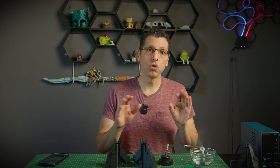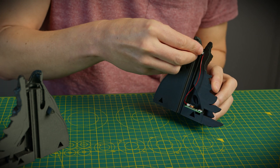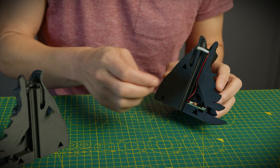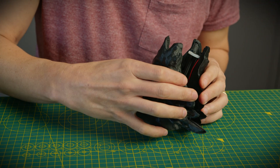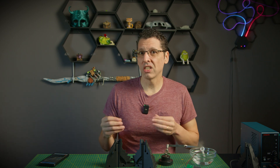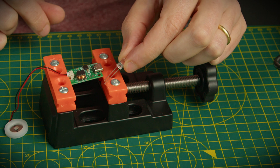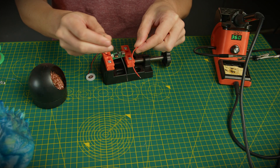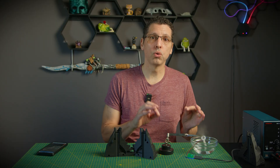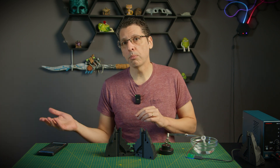Assembling is super easy. If you choose not to install the LED light, just fit the board and the transducer, close it, place the tube that transports the water, place it over the water and connect the USB. I also included a plate 3D model for you to print, where the water will not reach the USB connector — it's never a good idea to mix water and electronics. Assembling the version with the light is also easy, but for that you will need a 100 or 200 ohm resistor, a 20 milliamp LED light in the color you like, a soldering iron, solder, and two pieces of electric wire. The only additional thing you need to do is solder the resistor between the LED and the board power output — it can be on either the positive or negative side.